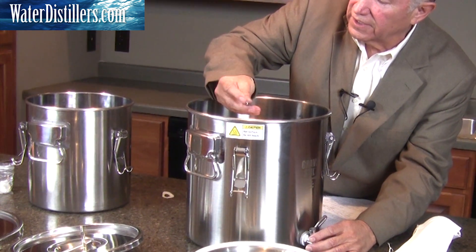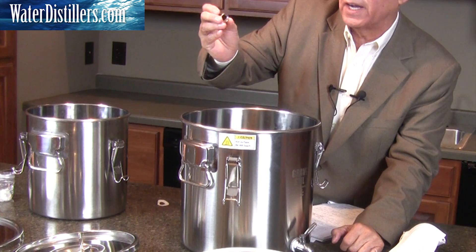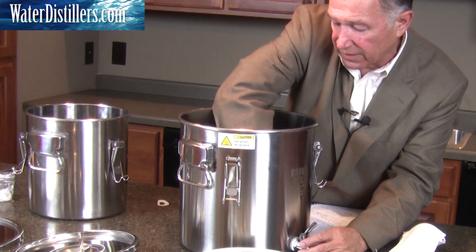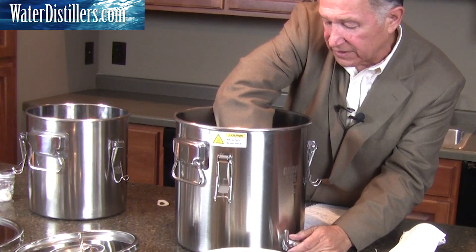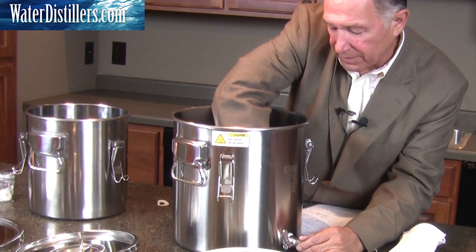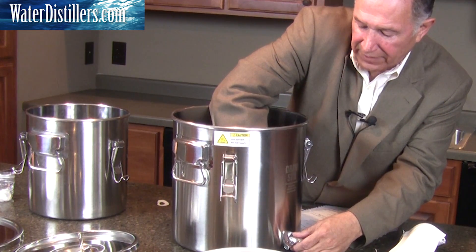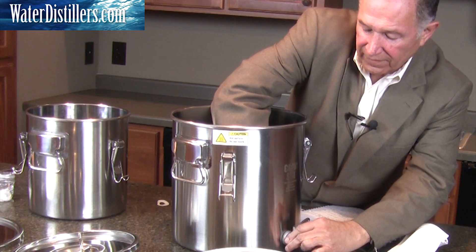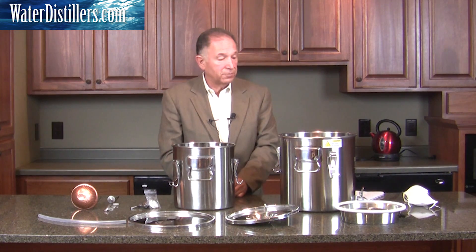There's going to be a point where you can no longer tighten the threads with your hands. When you take a look at the nut, if it's not going on right away, just flip it over to the other side — that'll save you some time. Now we're just going to tighten it up really quickly with our hands. All you really need to do is hand tighten it. After I've tightened it as tight as I can with my fingers, I turn this valve up here nice and tight while clamping on the other side. You might want to put some water in there to make sure you've tightened it enough.